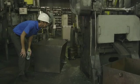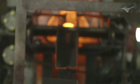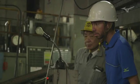So by starting with the 1025E billet, you're able to ensure that the grains of the metal flow continuously from heel to toe. Metal is a lot like wood in that if you think of it, everyone knows wood has splinters and grains that run along the length of it, but metal is very similar where it actually has microscopic grains. So if you're able to get those really tight and consistent and flowing along the length of the club head, you can get a more consistent piece to piece. You're also going to get a truer vibration and a better feel from the golf club. So we take a mild carbon steel billet, we bend and stretch it into a proper shape, and then we go into our primary forging step.